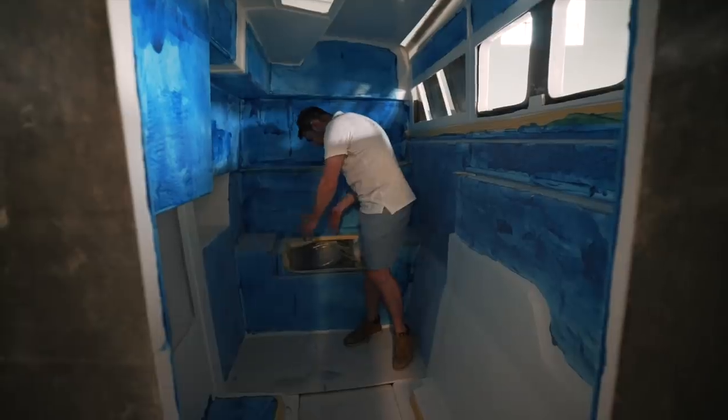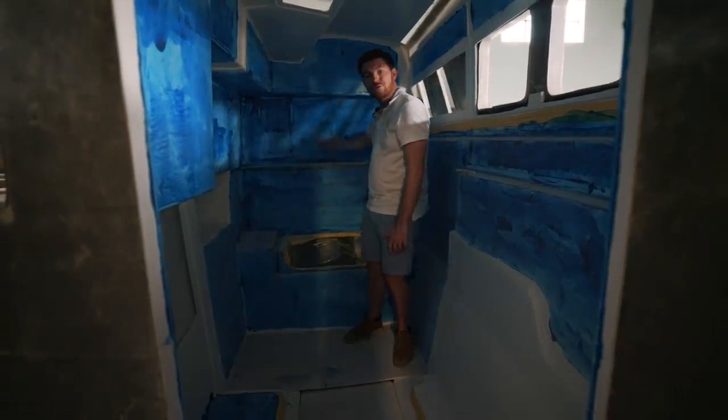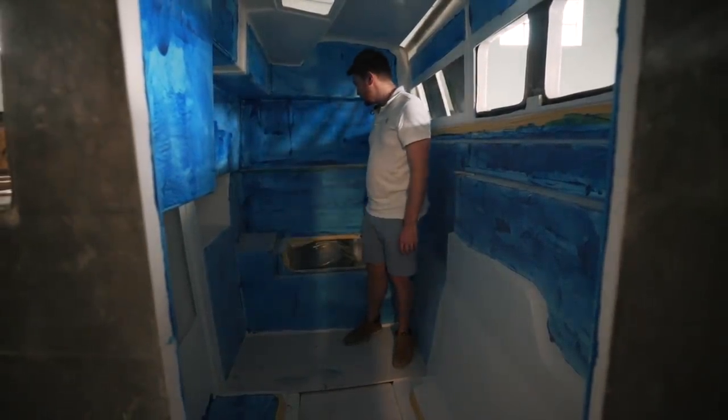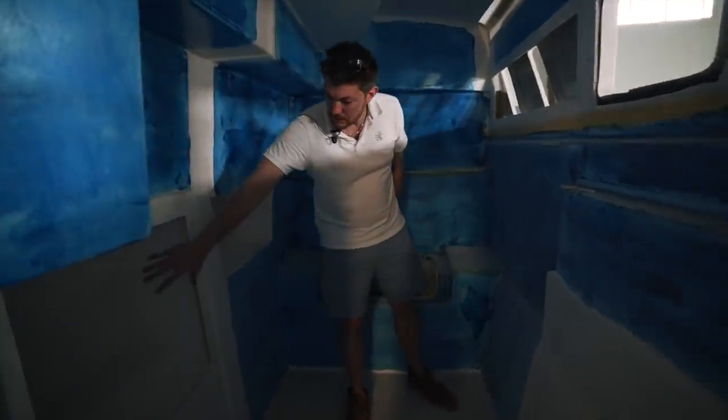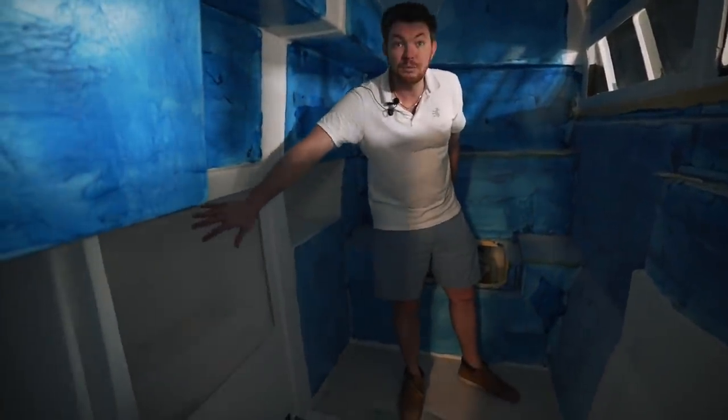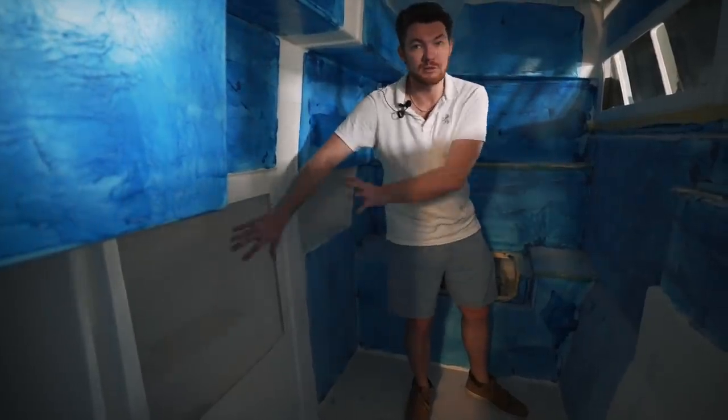And then you've got your access to the sail drive. So for doing oil changes, the sail drive, this is the place to go. You're directly above it. You've got access all around the sail drive. And for everything else on the engine, you go through the engine bay hatch. You've got some storage around places like this, and here is where we have some of our water maker equipment installed, or if you've got other options, you can put other equipment in there.